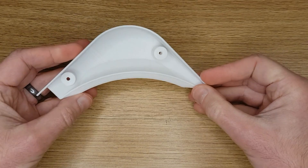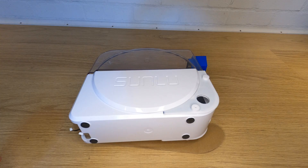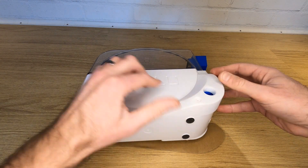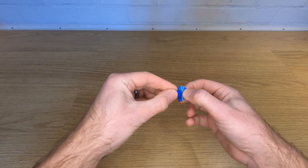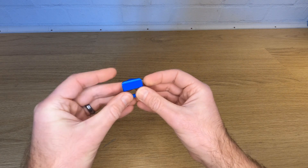Print the left hand side cover so you're ready to attach it when you've finished with the timer settings. I have included right hand side panel parts to add an intake vent to the lower rear right hand side — it's up to you if you want to use this location or put the vent in the front of the box. Either way, print all of the parts for the 20mm vent. This is the same setup as the 40mm vent except it only has two blades instead of three.